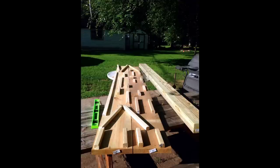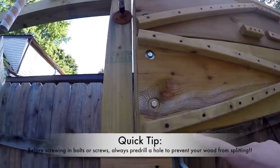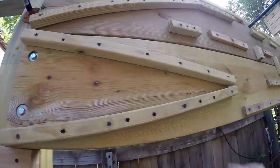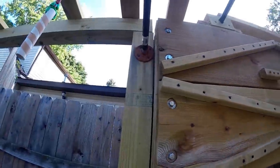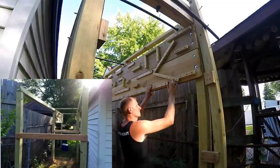Once that's done, you're ready to start your ultimate cliffhanger. Start cutting your two by twos and then lay them down in the design that you think will work. Once they are all in place and good to go, you can start screwing them down. Make sure you pre-drill every hole, otherwise the wood will split. Once that's done, you're ready to add it to your structure.